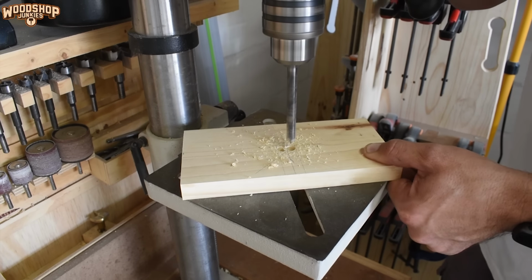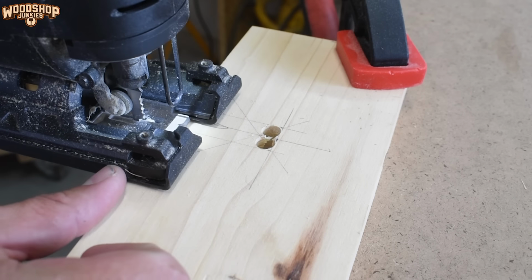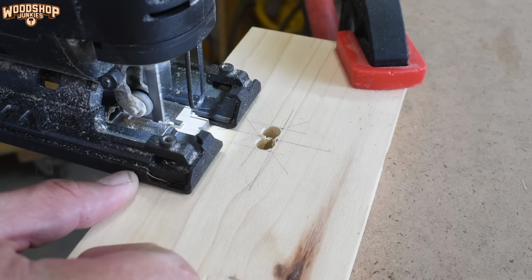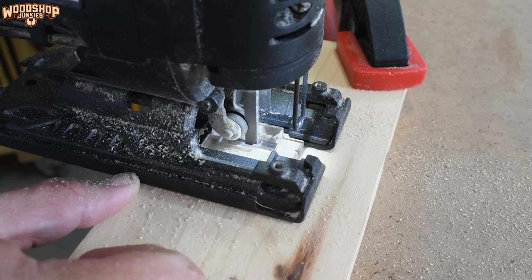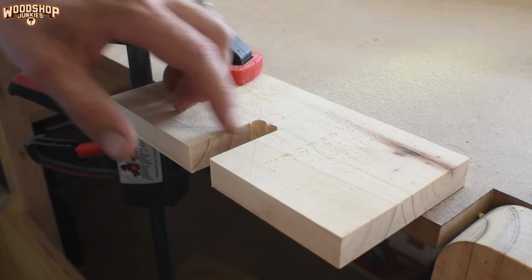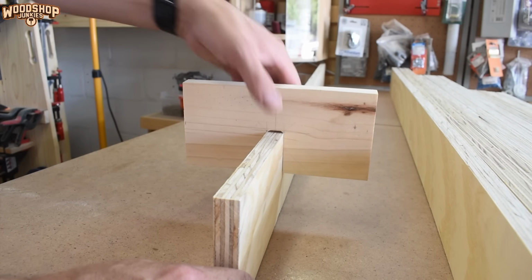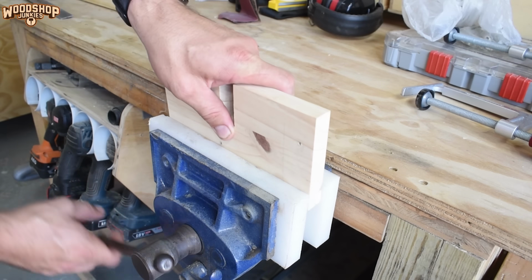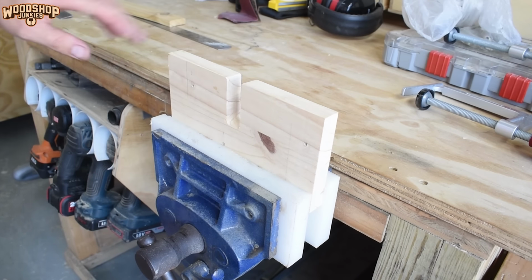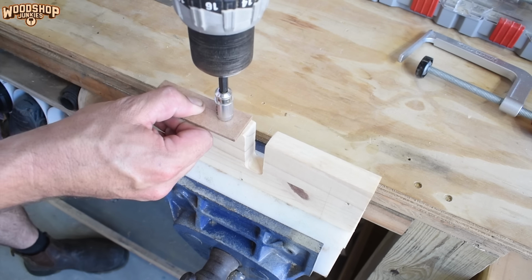This system is going to be sacrificial, which means that it is going to be subjected to a certain degree of wear and tear, and over time some components might have to be replaced. That is why I'm making the cut guide. When I have excess plywood material, I can cut it or break it down into one of the 3 standard sizes for this system and use the template to very quickly add slots to it. This will allow it to function with the rest of the system and replace any damaged or worn out component.